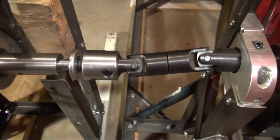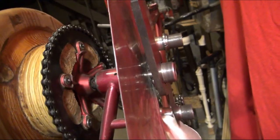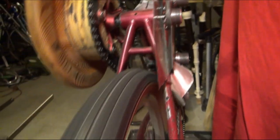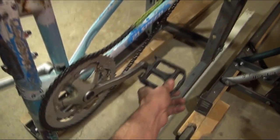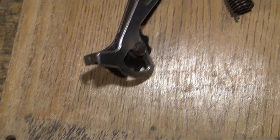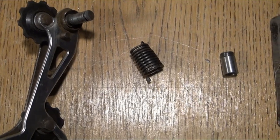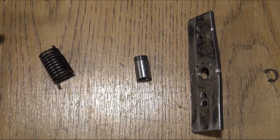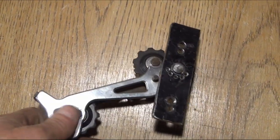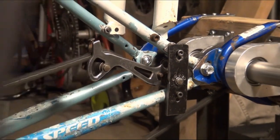Now the pedal drive can spin the chop unit, the blades, and the hand wheel, which I'll talk about later. But the pedal drive isn't quite complete — its chain is slack and needs a tensioner. I made this out of an old derailleur cage, its spring, a little sleeve that I turned, and a bracket that I shaped. It has kept the chain in line all summer without fail.